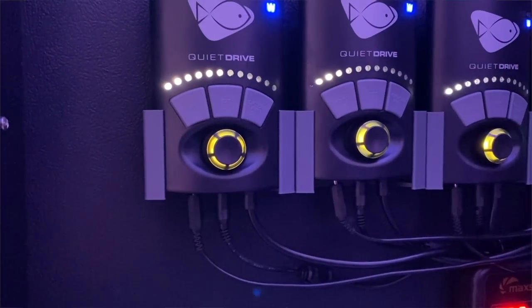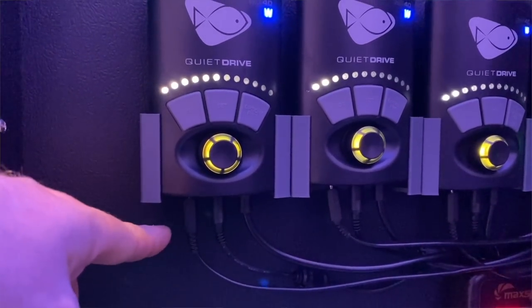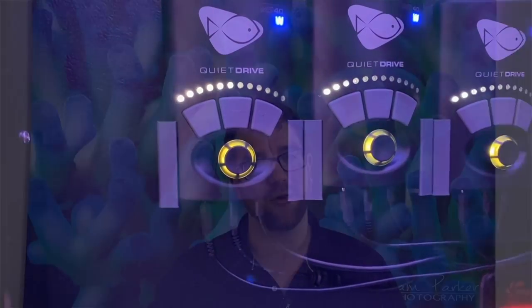All right, starting at the complete easy end of the scale and using my example, and an example that exists everywhere out there in the reefing world, the wave maker from Ecotech Marine called the Vortech is the easiest thing under the sun to provide a battery backup for. You don't need any kind of electronic wizardry at all. They've done all the hard work building the battery backup circuit for you right into the controller. You literally plug a 12 volt source into that extra little connector on the bottom of the controller, and your wave maker is now battery backed up. It's as simple as that.